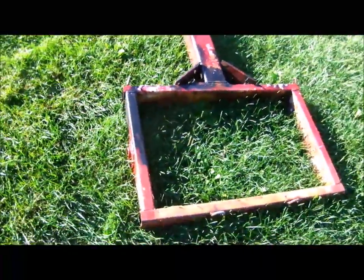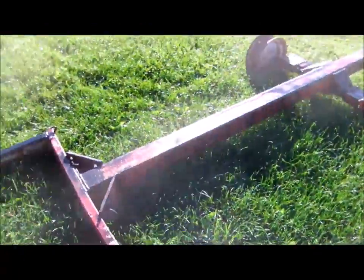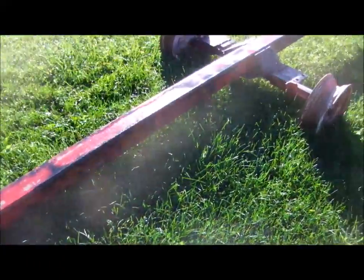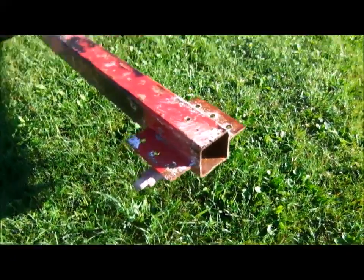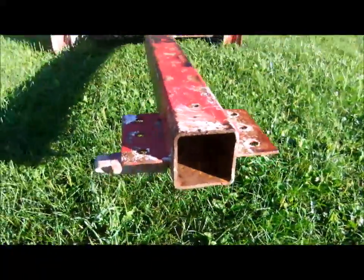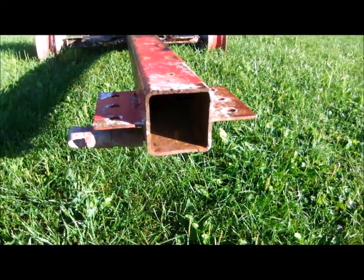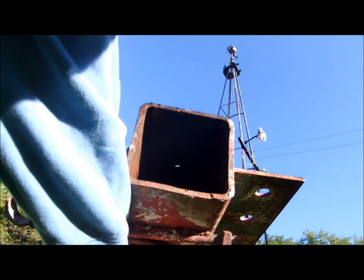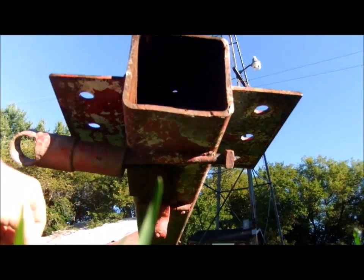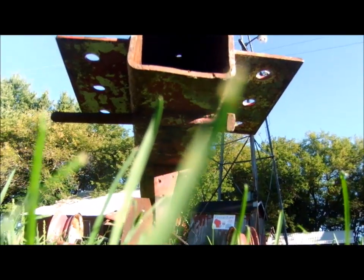Down here this cradle is perfectly sized to hold a 55 gallon drum that we can fill with water. If we want to get more ambitious I have filled it with stone, which was part of why it broke I think. This is the end that takes the wooden part of the throwing arm — about a four and a half inch square opening, so the piece of wood needs to get shaved and slid in there kind of like a telescope. On the underside here is the firing mechanism. This hook takes the chain from the trebuchet and when you're ready to fire you pull this pipe off, it dumps it down, and then you fire.